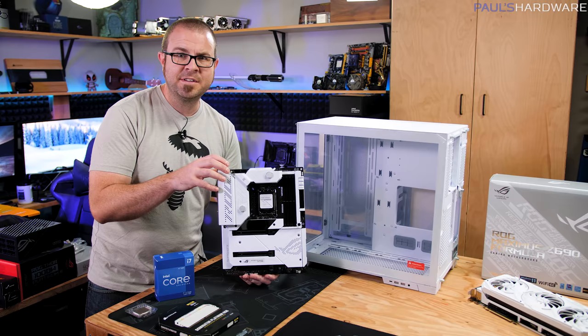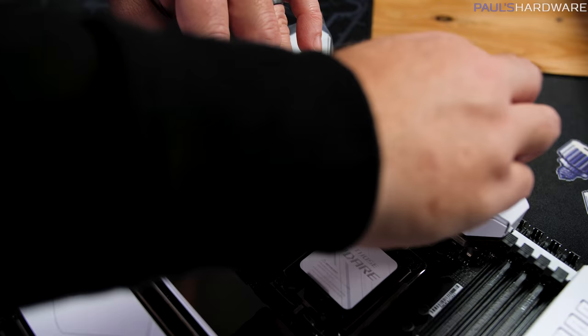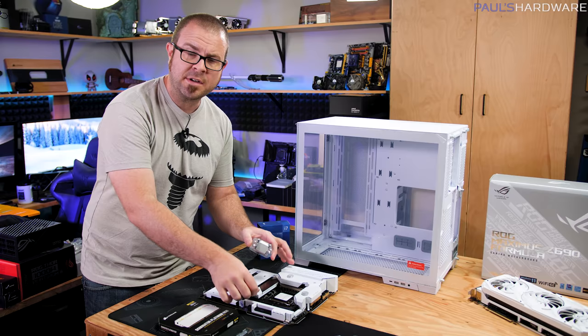And I guess the one thing we're really not making use of here is the integrated water cooling, since the Formula boards for quite a few generations now have had integrated water cooling for the VRMs, and it's got an EK unit right there with G1/4 fittings that you can easily integrate into a loop. But for what it's worth, I just wanted to acknowledge that yes, I'm aware of that too, and I guess preempt some of the comments from the comment section. Let's get the CPU installed next though.